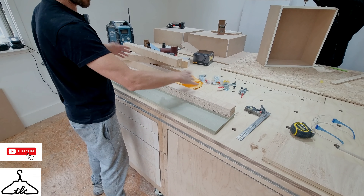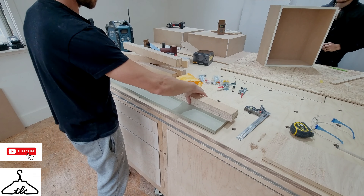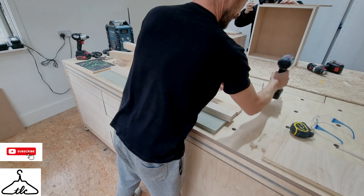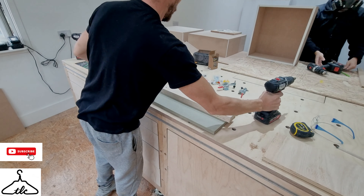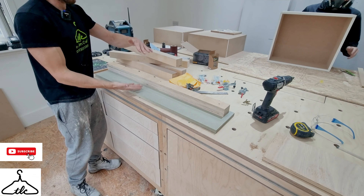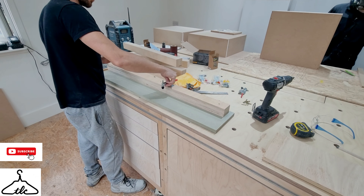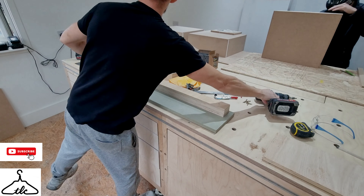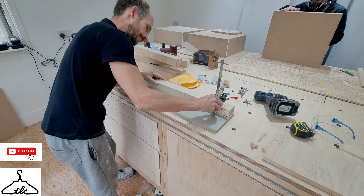So now we've done that — this is our fence, obviously not glued together yet. I'm going to turn them around and just screw them up one by one, keeping them flush and square as I go, using 30mm screws. The reason I'm doing them in layers is that if I'm using thicker or thinner table legs, the clamps will need to be at a different height off this fence — so you could just remove a layer if needed.